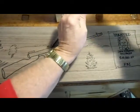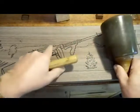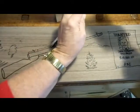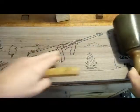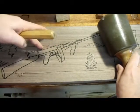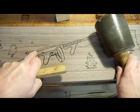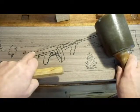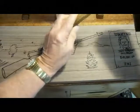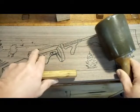The stop cuts I outline around the drawing. When I'm coming down here, I'm going in this direction to get a smooth edge up against my drawing. Because the grain is going this way, it won't chip out into the drawing — the chipping out will be done on this side. I stopped here because I didn't want this detail on top to chip off, so I'm going to put a stop cut there, just a kind of a plunge cut so my chip will end right there. That's how to keep it from chipping out.